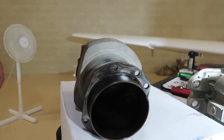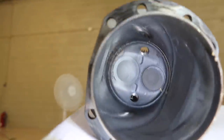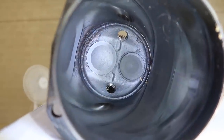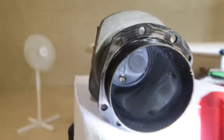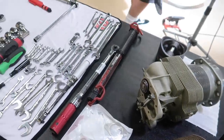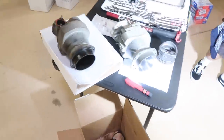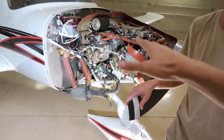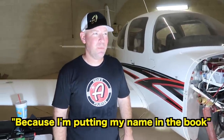The piston has gone in and out too many times and it's opened it up — worn out by thousandths of an inch but out of tolerance, so it's not refurbishable. What you see up top is lead deposit and carbon, which is normal and accumulates over time. The gaskets will be replaced as needed, and the next video is going to cover the fix — when all these parts go back onto the plane. Fingers crossed the temperatures are solved. I'm going to make sure everything is good because I'm putting my name in the logbook.